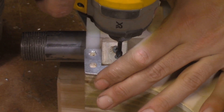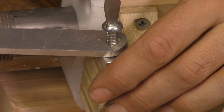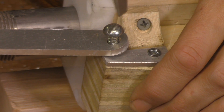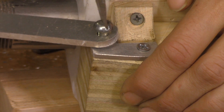But for this, a tiny bit of metal work got the job done. Then I also made an arm out of aluminum and screwed it into the body with a machine screw. I just undersized the hole a little bit, waxed the threads and drove it in and it threaded itself in and it's nice and secure. You could also make this arm out of wood, but if you have a little scrap metal around it is more rigid and stronger, so it is a better choice for this linkage.